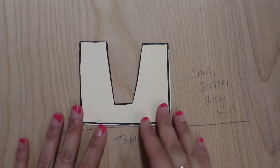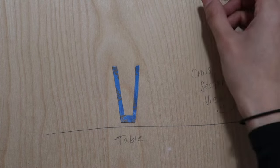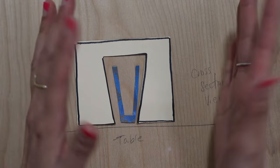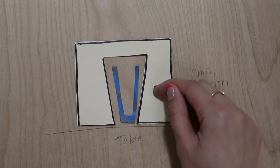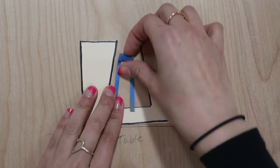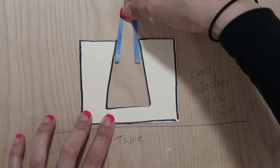Now I'm going to show you an example of an undercut. Here's the same cup, except we're going to pour the plaster as-is, so the plaster goes on top. Everything's fine while it's hardening, but after it hardens and we turn it around, you can probably see what's going to happen — the cup will get stuck and your cup is lost inside the plaster forever.